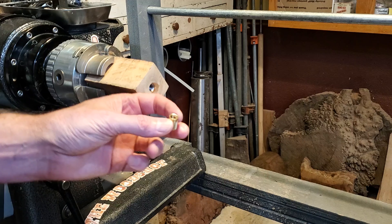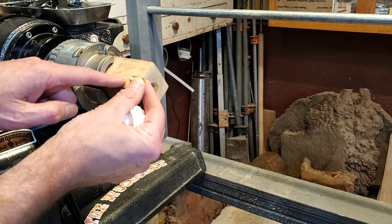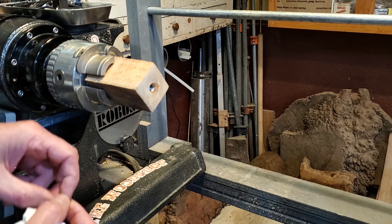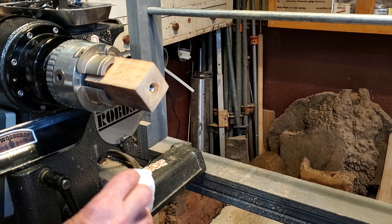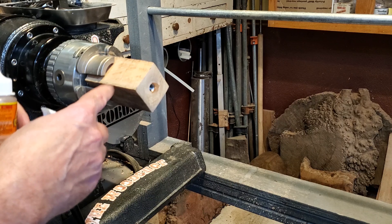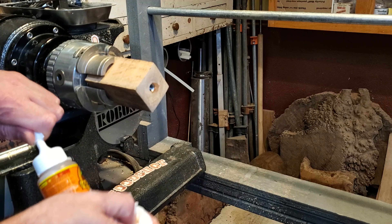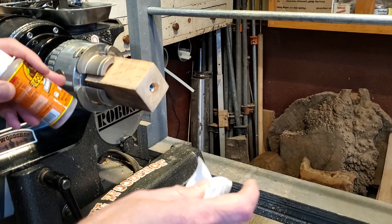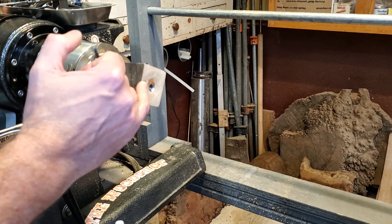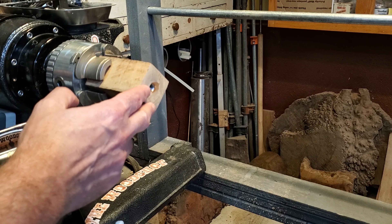I do the same thing with the brass ones. If you're using those for pizza handles, just drill in a little bit further so you have plenty of room for the thread, but you do it the same way and then they just screw right onto the mandrel. For a batch, I'll do about 10 — drill them all out on the drill press, bring them over to the lathe, press them all in, and let them sit overnight, then you can turn them.